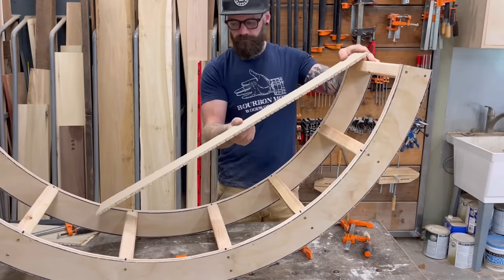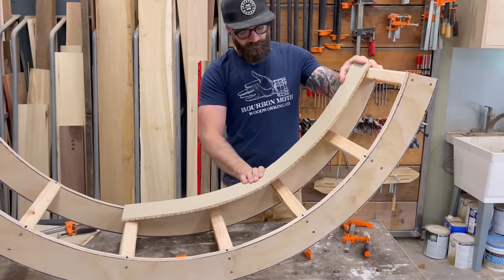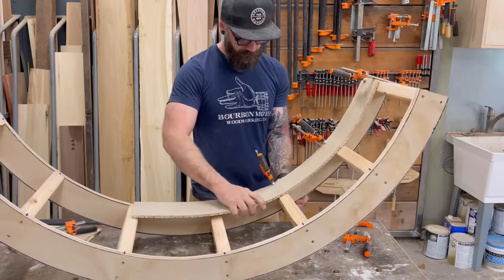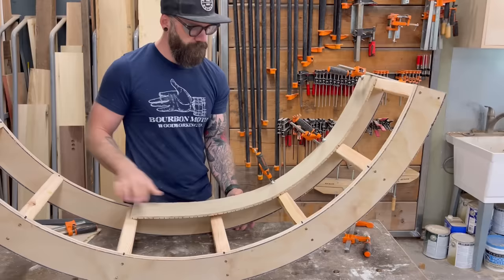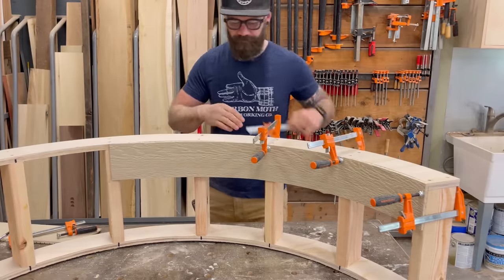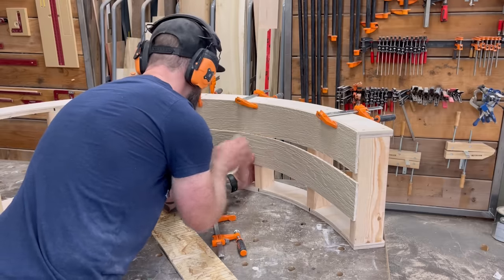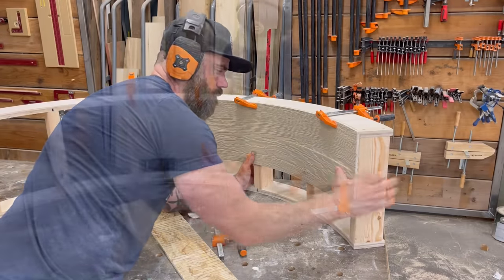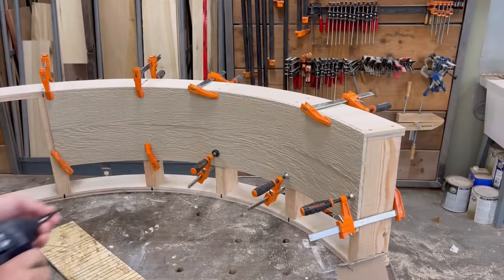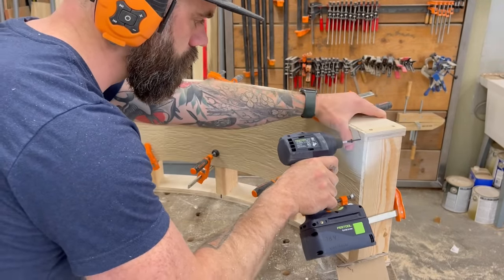When in doubt, kerf it out — as I always say. I went to the chop saw, set my miter saw to the trenching feature, and kerfed the back of all my boards. When I tested it, the board bent much better with all those kerfs. Then I called another audible: instead of doing the exterior form skin in one continuous piece and staggering seams, I'd do it in four separate sections. I'd have four even seams, which would look the best and be the easiest to take apart.